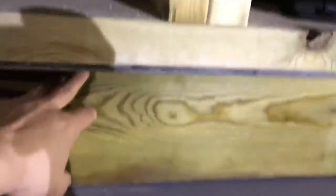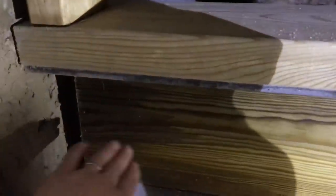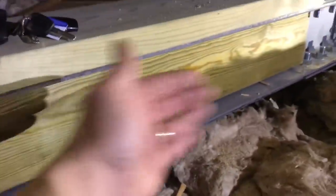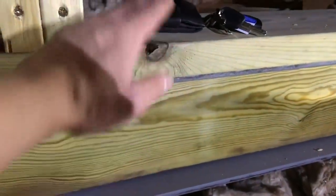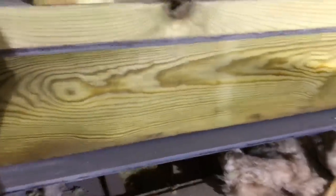Right, here we are in the cave of love. So this is what we're going for — we've ripped these timbers down to six and a half, because you've got the web of the steel, and then we're just going to butt that up to the wall, fix these through — two fixings per — through the whole length, and then we're going to run another timber across the front. That gives us a nice flat edge then to put our long joist hangers on, bend them over, then we can hammer them in, and then that will give us our floor level. So let's crack on, Andy.